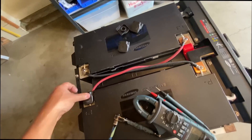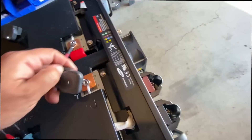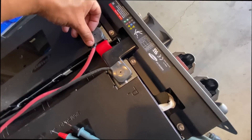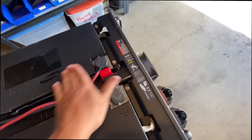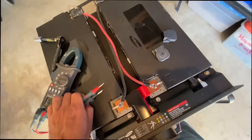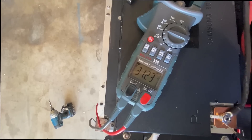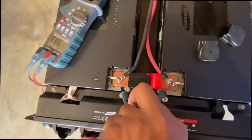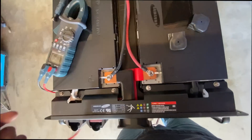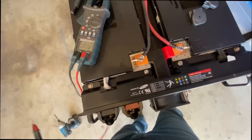These things still work — they kind of still do work. You can use these plastic covers to protect the cables, whatever you put on top. Let's check the voltage before we move on. Look at that — 31.23 volts, which is a bit high for a 24-volt battery.